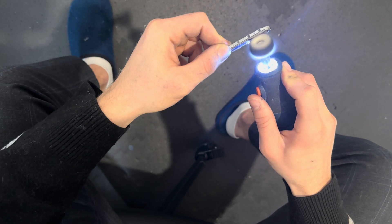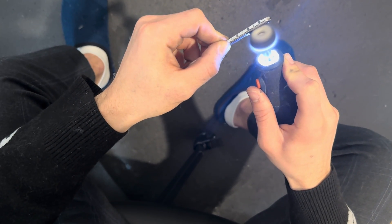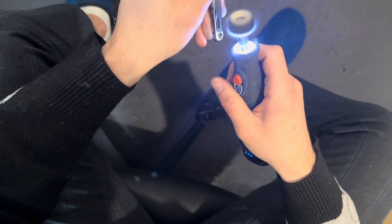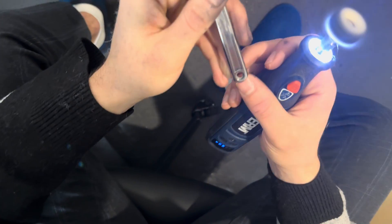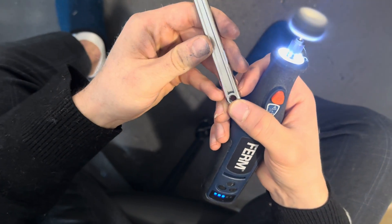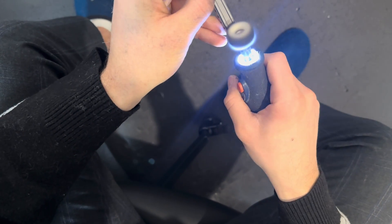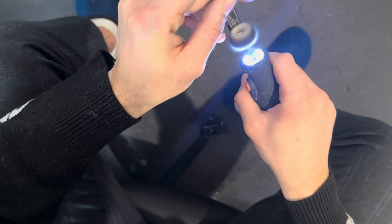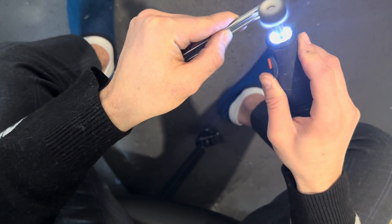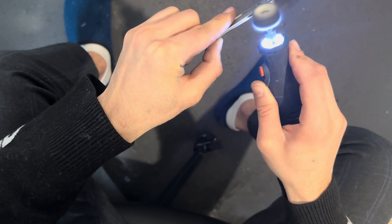What I did last time was try to get into a little crack here, and I used a different bit with a smaller edge to squeeze my way in there - which was kind of stupid, because afterwards I realized the different bit made a different finish and it just looked different once I was done with the anodize. As you can see from the polishing paste turning black, you can't really get into these corners, but I'll try to get in there as best I can so every scale looks the same at that spot.